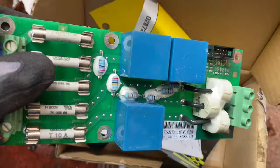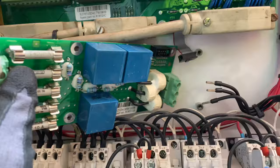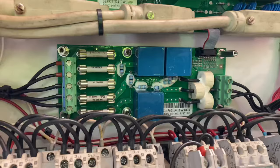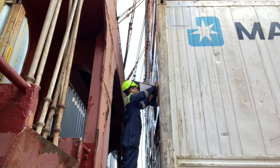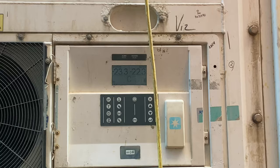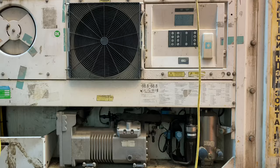That is why I decided to change the power mesh card. You need to use your proper PPE when doing this, and you need to switch off the unit first. It is also good practice to put all the screws in to secure the card. After changing the card, the unit went in range and ran in good condition.